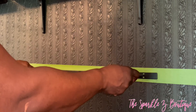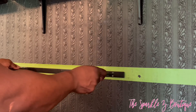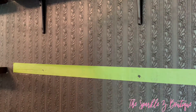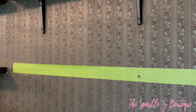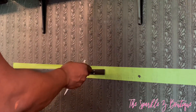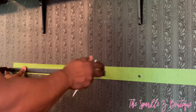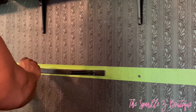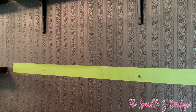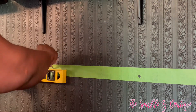Now I'm going to take this bracket and line up the holes of the bracket over the holes I made in the tape. Then I'm going to take a pencil and mark where the screws are supposed to go, and then screw it in. Next, I'm taking the bracket and matching it up to the shelf to make sure it's on the same level, marking it with a pen along the top line to make sure I'm placing it exactly where it needs to be to be level.